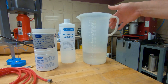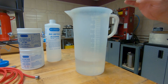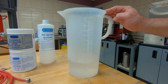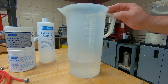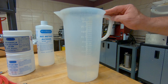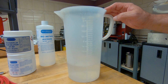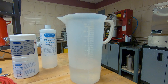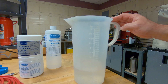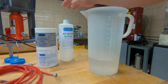You're also going to need a pitcher that is heat resistant — it needs to withstand the temperature of boiling water — along with one liter of distilled water. When the hydroflux solution is mixed it does get very hot; there is an exothermic reaction that happens. So the container that you use and whatever you use to stir it with — either a glass rod or a stainless steel spoon — needs to withstand that heat. Also you need to have some vinegar available; if you do have any spills of the electrolyte solution the vinegar will neutralize it. Additionally, read all of the safety precautions for personal protective equipment in the SDS sheets found on our site, attached to the Rio dry mix, the methyl alcohol, and the boric acid.